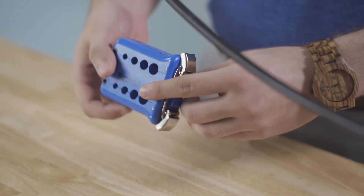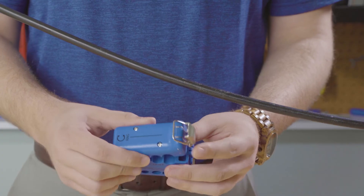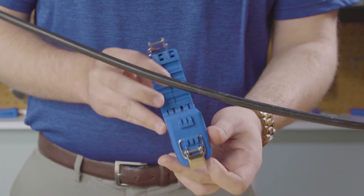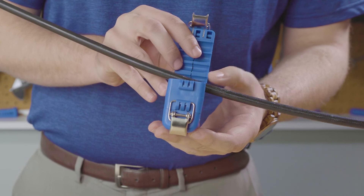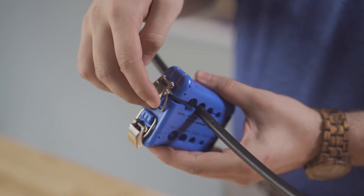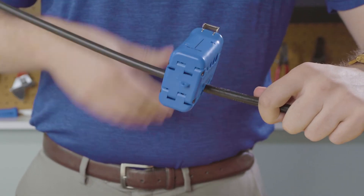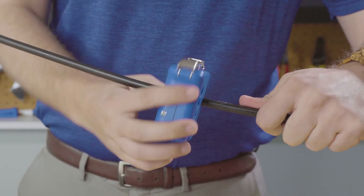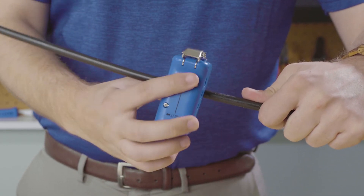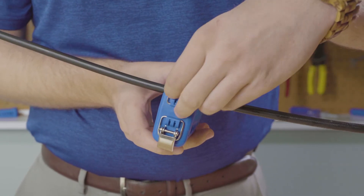For ringing, open the ringing side of the tool and insert the cable into the 9.8 to 10.4 millimeter ringing groove. Next, clamp the tool shut. Turn the unit two to three times. You can hear the strength members breaking and you'll know it's time to release the tool.